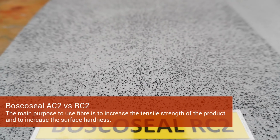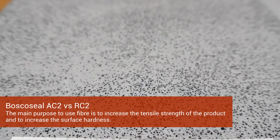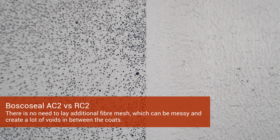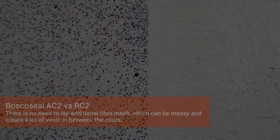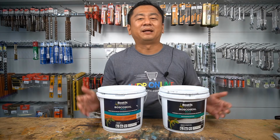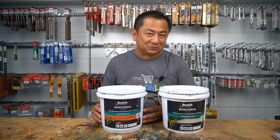The main purpose to use fiber is to increase the tensile strength of the product and to increase the surface hardness. Therefore, there's no need to lay additional fiber mesh, which can be messy and create a lot of voids in between the coats. Thank you for watching my video, and I hope that all of you have a better understanding of Bostik Boscoseal AC2.